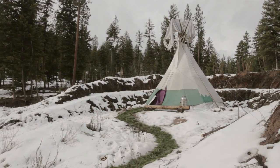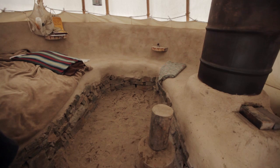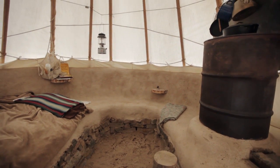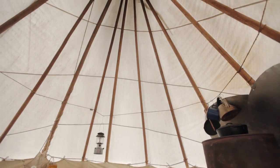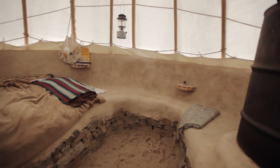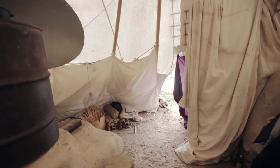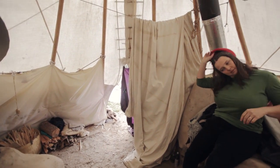This is our great rocket mass heater in a teepee experiment. The walls of a teepee are canvas thin — not exactly a well-insulated thing — so we've got a rocket mass heater in there. Last year we had a couple in there. It did get to 26 below, and in the morning when they got up and the fire had been out for eight hours, they got dressed and went outside and were surprised at how cold it was. On the inside it felt like it may have been 55 or so.